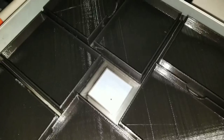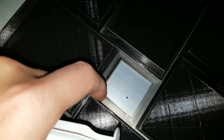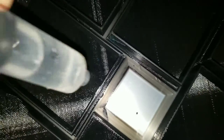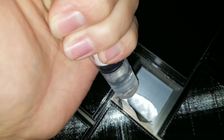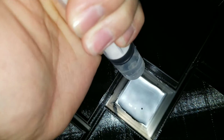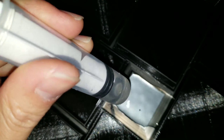Now I'll show how to easily remove the print. You can see this piece was printed so close to the bed it's almost see-through. There's really no way to just pull it off directly — some people try to scrape it off and damage their print. All you need to do is get some water. I put it in a syringe to make it easier, and just put it in the edges so the water will work its way under.